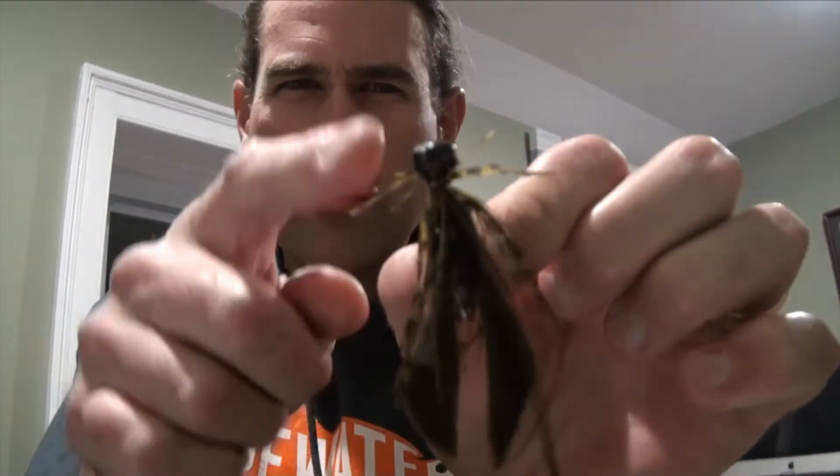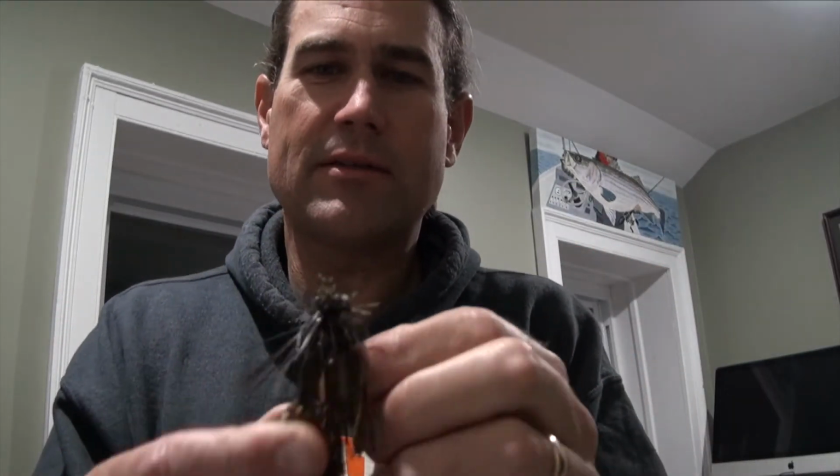That's it. So, you know, it's very similar to the finesse jig with the Ned head that I've been making, but this one involves modifying a mold that was made for the bristle guard. And honestly, you could take the Ned head one, the Midwestern finesse jig, and find a way to get a bristle guard in that. That would be fine. But I just wanted to start small, and I had that ball jig with the bristle guard in 3/32. I haven't messed with those. 3/32 and 1/16, and I just expanded those cavities to make this.